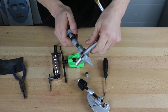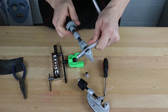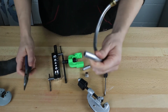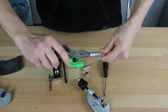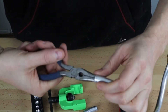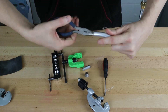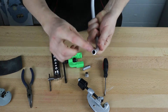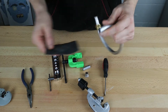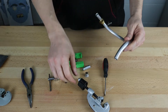Let's show you how to make those cuts first. After I cut my tube, I like to take the needle nose pliers and very slowly work it back and forth. I don't want to push in too hard because that could flare it out and I won't be able to get my nut on — make sure you get your nuts on first. Just want to take that edge out. That sharp edge can be ground down with your sandpaper — just make sure it's smooth and ready to go.